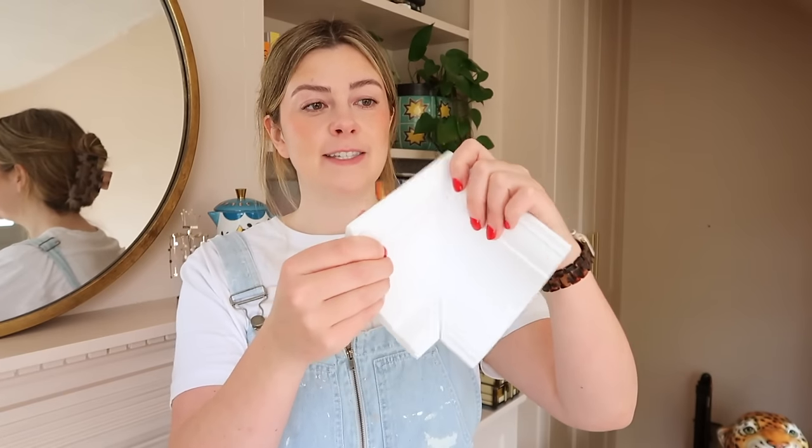Obviously if you're experienced at this kind of job you'll know exactly how to slot pieces together and get perfect corners. However, if you're a newcomer, I was absolutely delighted to see that they sell pre-cut corners — already sliced perfectly to slot together so they can just be glued into the corner. That basically just minimises the amount of sawing, which if you're as clumsy as I am is always a very good thing. I'll paint these — they might need two coats, we'll have to see — and then once they're dry we'll get to sticking.